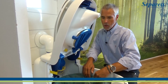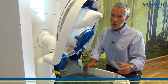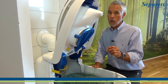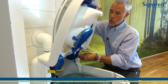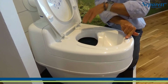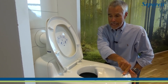When that comes out, we might have a little condensation in the bucket, but we're not cleaning waste out of the bucket — just a little spray cleaner, wipe it down, and it's nice and clean. For general cleaning on the toilet overall, use a non-abrasive spray cleaner. On a weekly basis, open it up, spray it down, wipe it down with a paper towel, push the button, and throw the paper towel right in with the solid waste because the paper and solid waste can both go into the compost area and will break down.